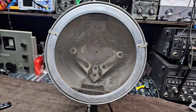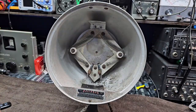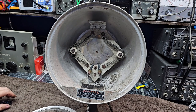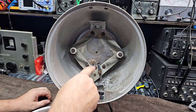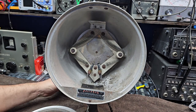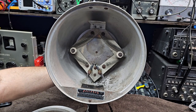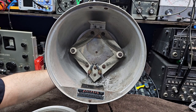Let's take a closer look at how this gizmo works. This shield comes off real easy, and it's a very basic thing. There are two rods of carbon here. In order to start it, you have to strike the light. Behind the light there's a knob, and as you can see, one of the rods is moving. I can touch the other rod and strike an arc, and then I can tune the brightness and length of the arc by moving this. If I move it too far, of course, the arc will stop.